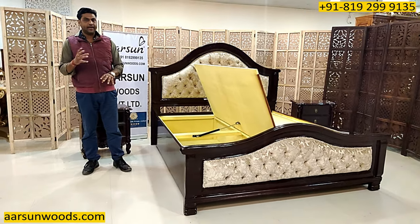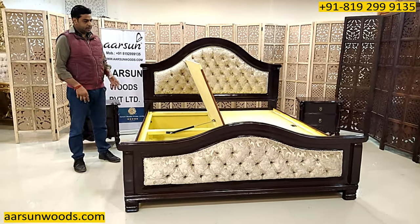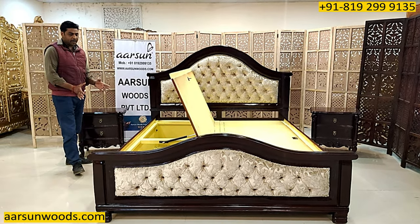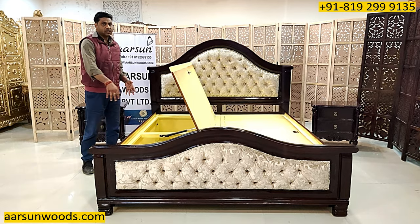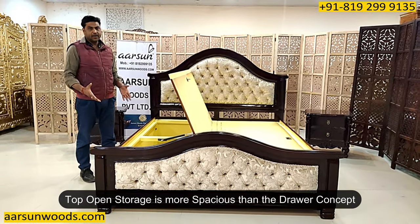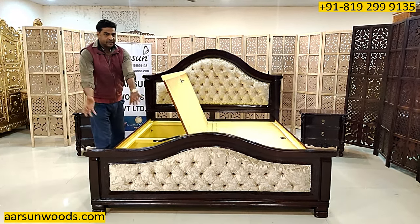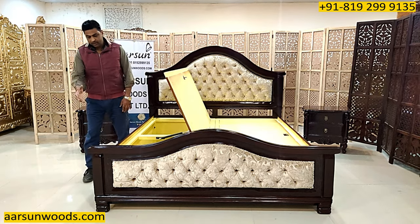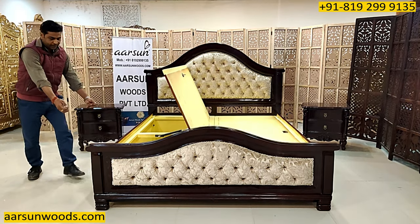Generally when you have the drawer concept on both sides, there is a lot of space that is wasted to get the drawers done, because both drawers will have their own sides and they need space for the channels and the front part, so it requires more area of the ply on both sides and captures lesser usable space. Also, when you have a bigger suitcase — international suitcases are quite big — those drawers won't work, but with this top-load setup you can put everything in at once as an open area. Additionally, drawers require the same area to open; a two-foot-wide drawer needs two feet of clearance to pull out.